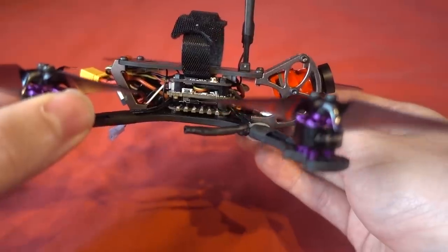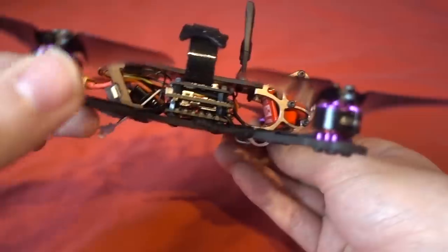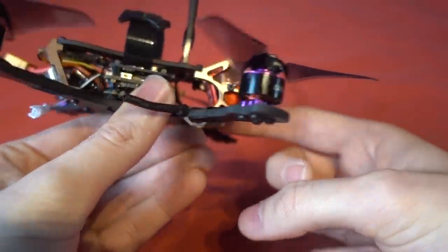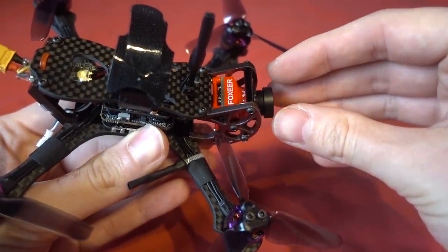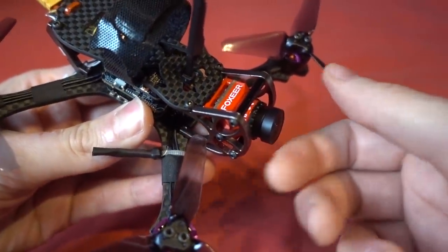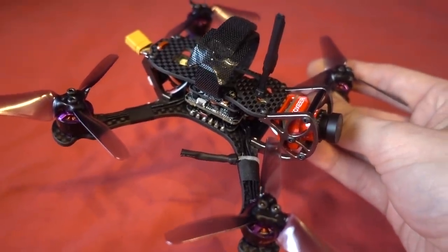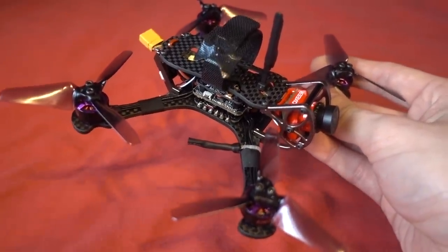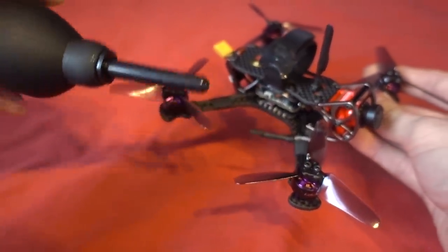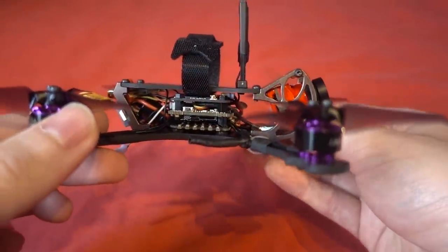Another thing that I had to do was clean a bit of dirt from the sensor, and the way that you do that is there are four screws on the back of the camera, and that removes this whole front and housing. Don't try and unscrew the lens because it looks like they use a special tool to do that. And don't use anything like a cotton bud because that's just going to add more dust. Instead, get one of these air blowers, and that sorted that problem out.